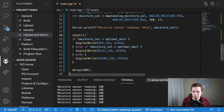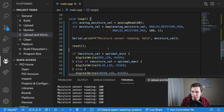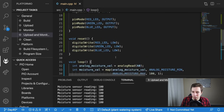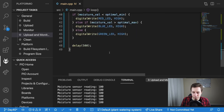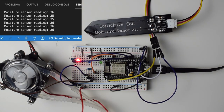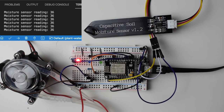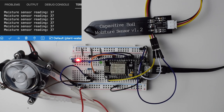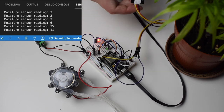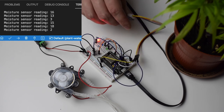With a 500-millisecond delay at the end, let's see how it looks. The blue diode is on because the moisture sensor is inside the water. When I remove it from the glass, it immediately changes to green — which looks a bit yellowish but it's really green — and then to red because we're below the optimum value at around 37 percent. Now let's test with the real plant.